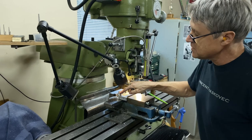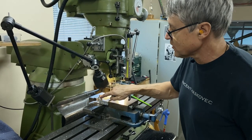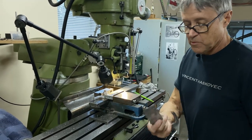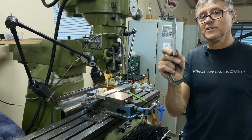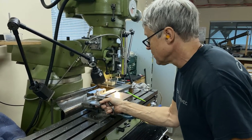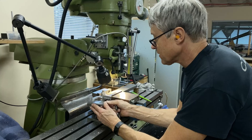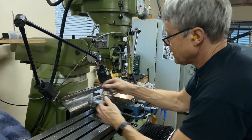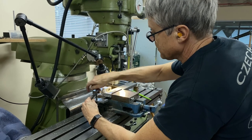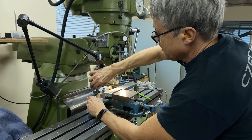This section is about three inches long, so when I mill that it's going to vibrate. One way I can fix that — I've got a wedge, an aluminum wedge I've had forever. If I put that under there and then put a C-clamp there, it's not going to vibrate because it's held up. It's sort of like the little jack that I used.